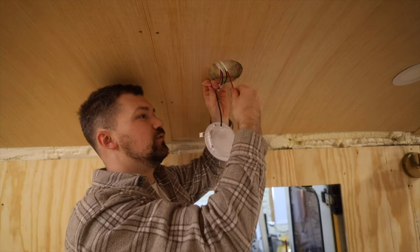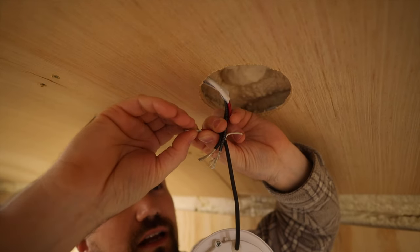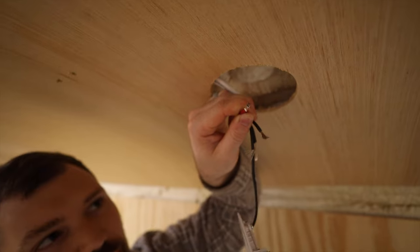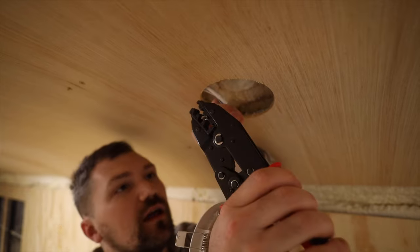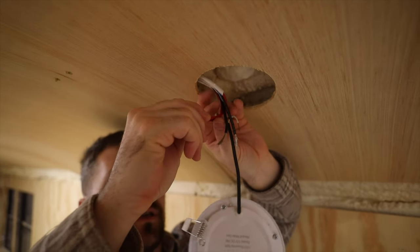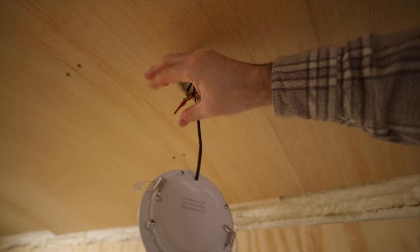And then I bring the other one in, and then the ferrule. Now this can be a little tricky to get on. You want to make sure you get it on with all the strands inside the ferrule. And again, we like to keep it hanging out a little bit, right? So we make our first initial crimp. And truthfully, that would probably be good enough, but I'm an overdoer and I like a really tight connection. So then I come back in and I really put the crimp on it. We push this on. Press to close our end. Ooh, spicy.